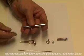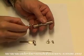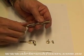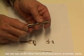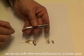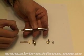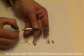So I've pressed it in quite hard, and again I'm going to put this assembly back in. And again, test the tension by putting the needle in. Okay, now it's quite tough. It's actually, you can really feel that it's got to the seal. You can actually see the airbrush moving as the needle strikes the seal.